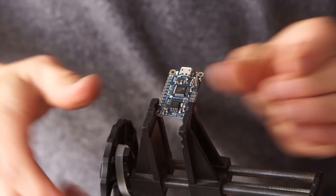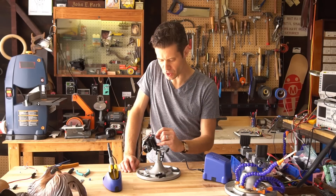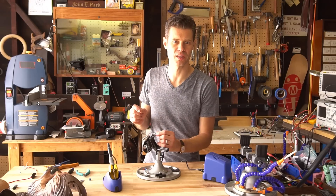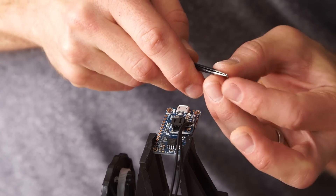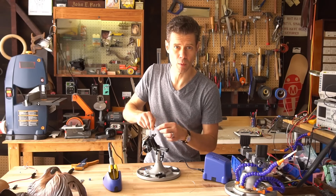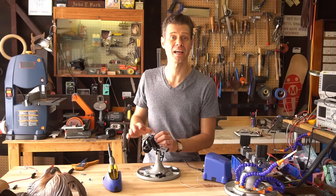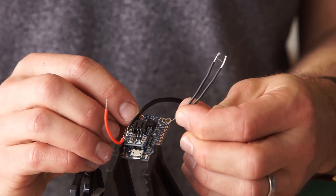Now that I've got that soldered in place I'm going to place the backpack on there. Next we're going to take a little two-inch piece of wire and attach it to the header pin on the battery pin of the LiPo charger, and that's what's going to run over to the amplifier circuit. You can twist the wire up a little bit so that it fits around the pin using a pair of tweezers — that'll give it a little more mechanical strength in the connection. Now what we want to do is prepare to run a couple of leads off of the ground on the audio effects board, and those are supposed to be connected both to the amplifier and to the momentary switch of the mask.